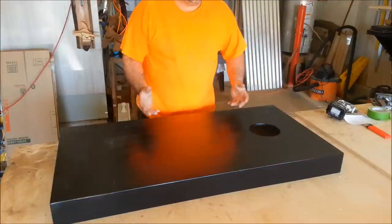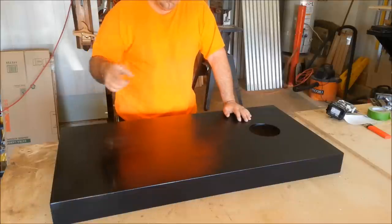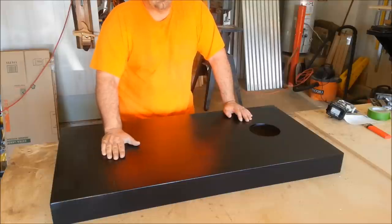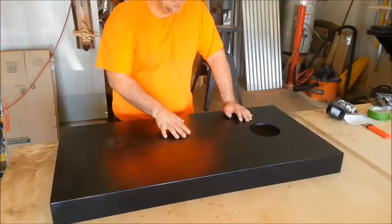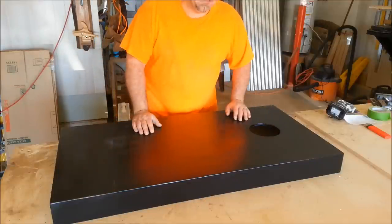If you're going to put it on painted furniture, like we saw earlier in the kids dresser, you want to make sure you use a semi-gloss or a high-gloss paint on the surfaces that you're going to be putting the vinyl on. And if it's a kids piece of furniture, high-gloss is great because it's easy to clean.